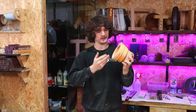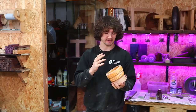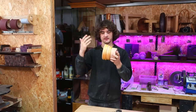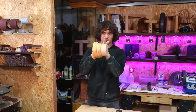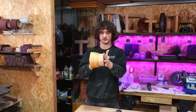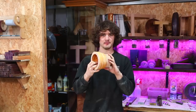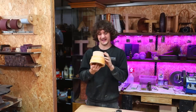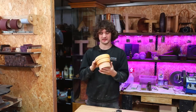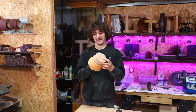Normally when I do bowls, I shape the bottom first and then hold the bottom in the chuck while I scoop out the inside. However, in this case, I've already got access to the inside and I need to shape the outside. The way I'm going to go about it is shape the inside first, then start shaping the outside, get the entire thing sanded, and then literally just cut this bottom off either using the bandsaw or try and get a parting tool in there. I think seeing as this is made of beech and beech takes a stain quite well, I might stain it.